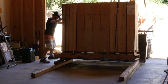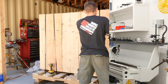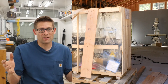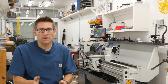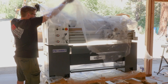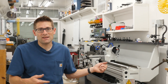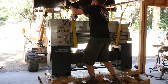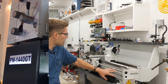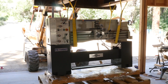Finally we got the metal lathe into the shop on the forks and set it down onto some wood. Then began the process of uncrating — this was the wildest unboxing experience I think I've ever had. It was really exciting to take off the boards and start to see this precision metal lathe and the accessories. I got the preferred package plus a quick change tool post. This lathe is meant to be lifted via slings with spreaders that go under the bed to keep the straps off the lead screws and feed rods. So I made some sandwiched 2x4 spreaders with rounded edges to be gentle on the straps, and we lifted it — worked really well.